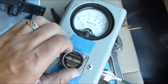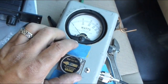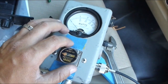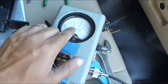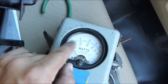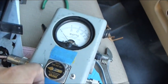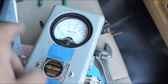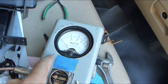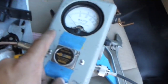This here is a slug for VHF. There are various slugs for various bands — UHF, high band, low band, HF. For this particular testing we're going to do VHF and just do one frequency. They have other models with a switch and more settings, with display data that factors in the discrepancies of the bands, because there is a difference when you change bands. But this Bird watt meter has been in the industry for decades and we still use it today. This is my go-to, end-all. Now let's transmit.